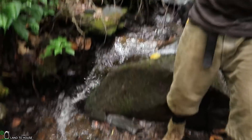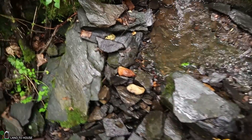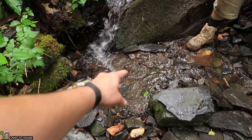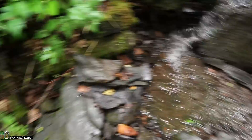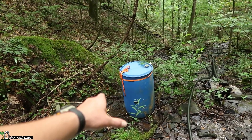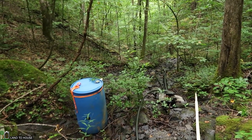In the previous episode, we dragged 600 feet of inch-and-a-quarter poly pipe up the mountain, and today we're going to be installing the screened intake in this little pool right here. We're going to dig this out a bit, make a little dam, and then we'll have our screens in here which will take two inch-and-a-quarter lines down to our 55-gallon drum. That will be our silt-free, air-free source of water that will take the water down this inch-and-a-quarter to the turbine.